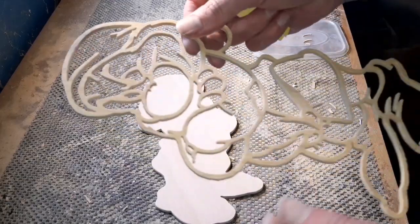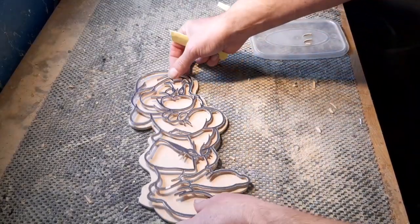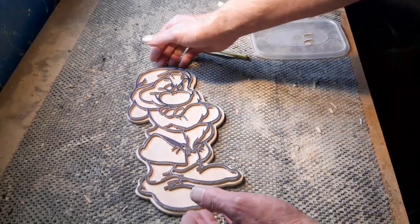Look for all your gaps. Think of your resin, the smallest of gaps, it will find a way to leak through. So quick tidy down, then we remove all this tape off here before we decide with the paint and the stain for the backer.